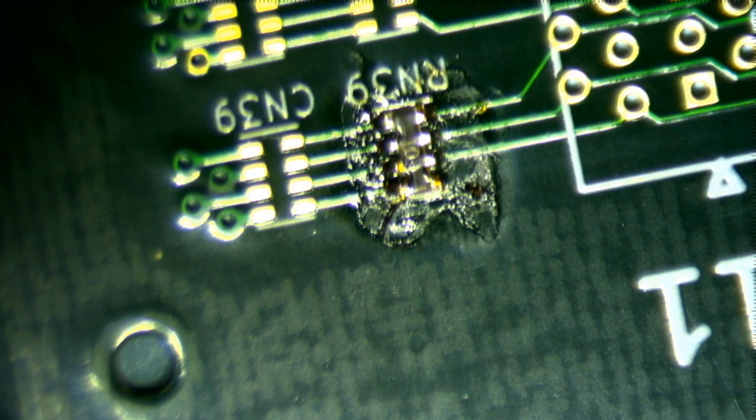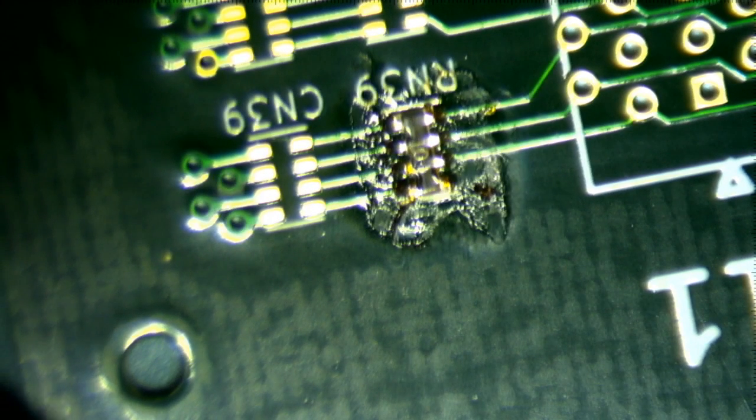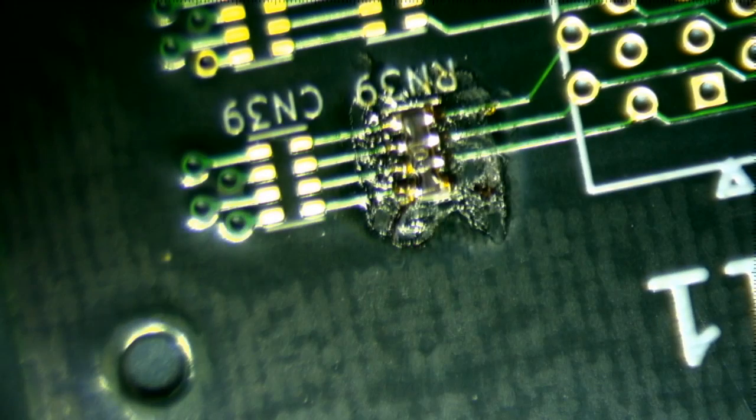All right, what about pre-tinning the pads before putting the part on? I've tried that, and the problem is that when you pre-tin the pads, they're not flat anymore, so the component doesn't lay flat on the pads. Because, you know, then you'd have to melt all of the pads at the same time. So, yeah. You pass too fast. Yeah, I might be passing too fast on the pads. That's certainly a correct observation.